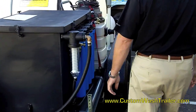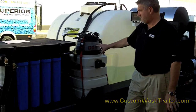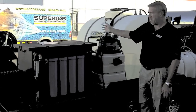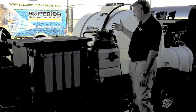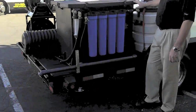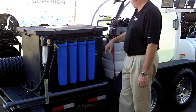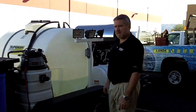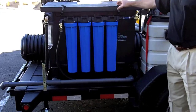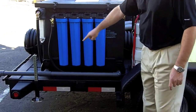We also put in a water treatment system here. You've got a vacuum boom system with a sump pump built into it, so when you lay your hose out with your boom, water gets sucked in, pumps out through the sump pump, runs through the filtration system, goes through the coalescing grids and foam filters — 150, 10, and 5 micron — and then back into your water tank. It's a heavy duty recycling system, ordered a little larger than normal. We also got a drain valve piped out, and everything is all Schedule 80.